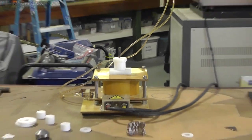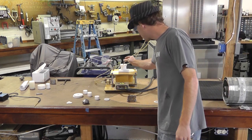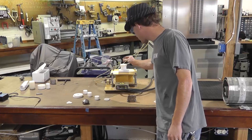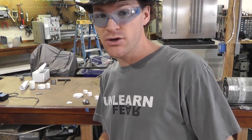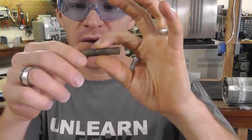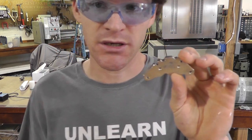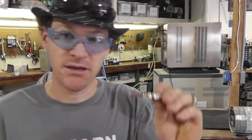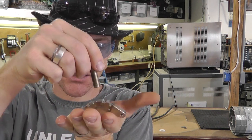That's the same height as the mu metal. I'm going to hold it this time because I don't want it to go flying off. Very, very weak — let's check it. The gauss meter shows 0.22 on either side, so it's nicely magnetized and about equivalent on each pole. So the mu metal actually helped in this situation, which is rather interesting. The mu metal focused the flux enough to basically allow it to magnetize at a decent strength, whereas normally from that last test it barely sticks. Interesting results — more research to be done, I assume.